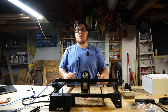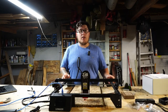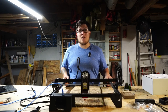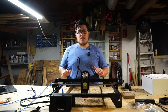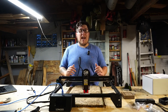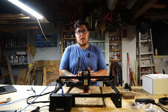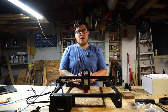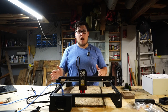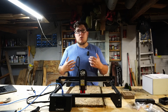On the Ray 5, Longer also includes a handful of safety features. The machine has fire detection built in, something that my Xtool doesn't have. It also has a gyro safety, so basically if I knock the machine around while it's operating, it'll stop running. They're also claiming the plexiglass shield is fireproof, which is super smart. And as another built-in protection, it can detect if it has stopped moving — getting feedback on the stepper motors — and if it's colliding with something, it will stop, so you don't have a laser continuing to fire in one spot and potentially leading to a fire.